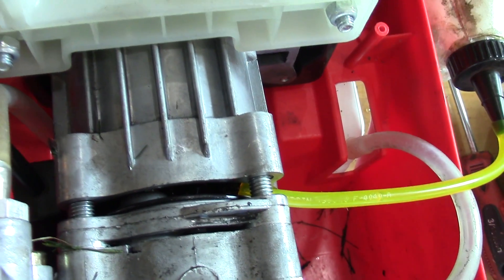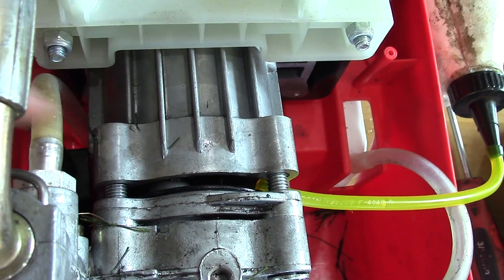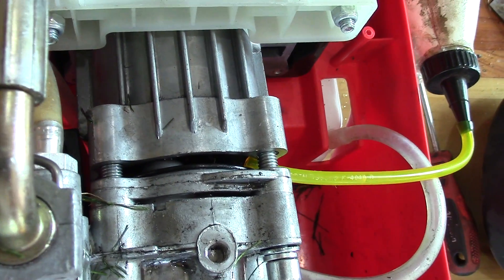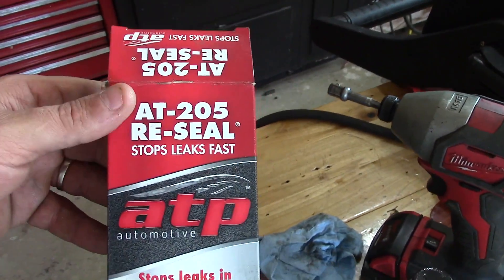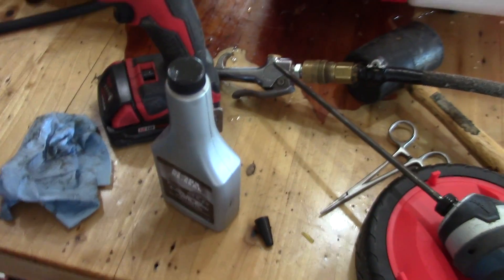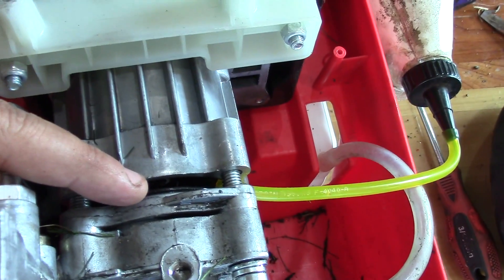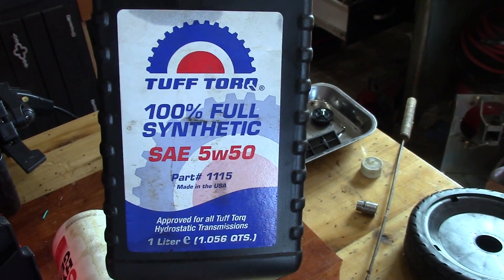Here's a look at the pump split apart. There's actually an O-ring in here — it's fairly thin. I don't have a replacement on hand that would replace that. So what I'm going to do is use this ATP AT205 reseal. This is really good stuff — you mix it with oil and it's a plasticizer, and it'll cause the rubber to swell up a little bit.